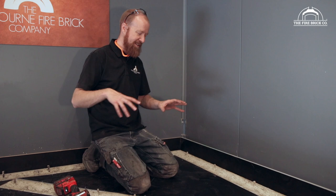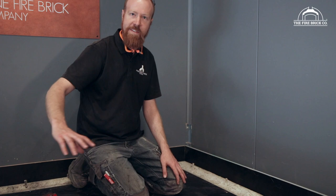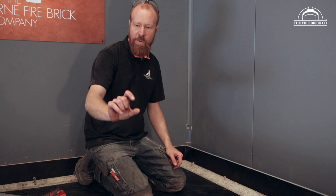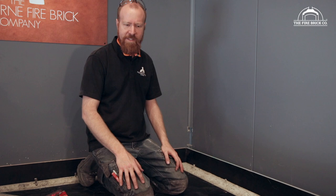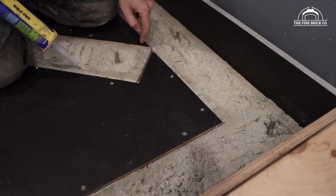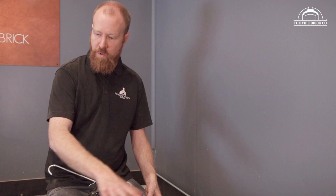There are some other cool practical things you can do with your stand. One of our customers got 3D-printed lettering that he stuck to the formwork and wrote messages to his grandkids — when the form was pulled out it left the impression of the letters. I've seen others put a family name and the year it was made on the inside of the front edge. Concrete is a really permanent thing — if you put something into the formwork it's going to leave that impression. It's kind of fun.